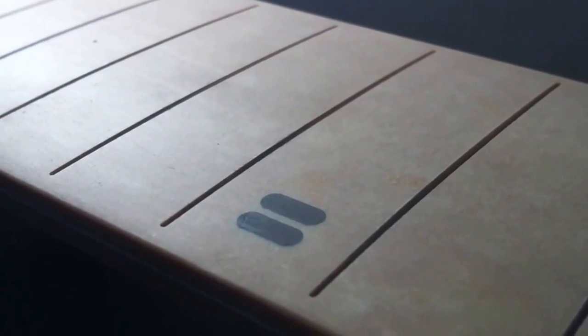What I've done is started off by cutting channels for the inlay in the fretboard, and those are filled with black resin. Wait 24 hours for that to cure, go back, run it again on the CNC, and cut a smaller channel within that — so I actually have about a half millimeter black border. That is subsequently filled again with the glow-in-the-dark material. This is my first experiment with mixing the glow powder with the resin, and I went a little light on the powder and a little heavy on the resin, so it's not as dense or intense as it could be. But that's the 12th fret inlay, and you can just make it out glowing there.